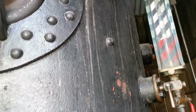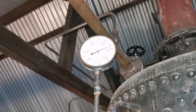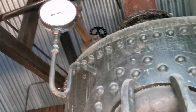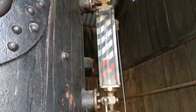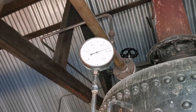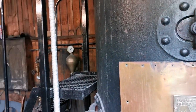Now as a safety measure there's a blow-off valve and that's linked to the pressure. You can see the pressure gauge up there — I've currently got around 75 pounds of steam pressure in this boiler. That's more than enough to run the engine; the engine will run from around 40 psi. There's also a blow-off valve that goes off at 80 pounds — the safety valve will open at 80 pounds of pressure and vents directly out through the ceiling. But there's another backup safety measure: there's actually a lead plug inside the boiler quite low down. It doesn't quite correspond to the level on that water gauge, but if the water gets too low, it'll expose the plug.